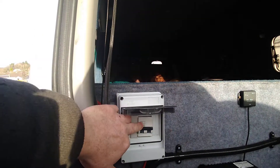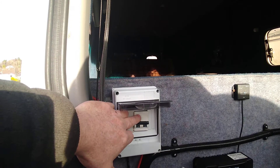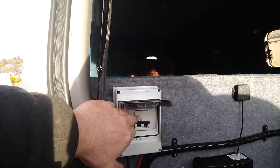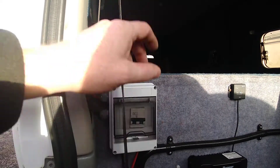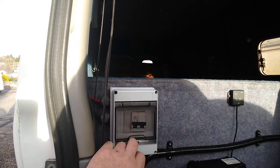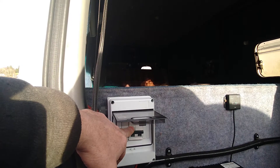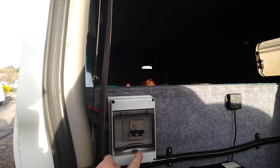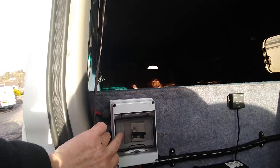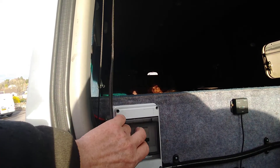What it is is a 250 volt 63 amp breaker, and it's DC rated. You would never ever use an AC one — remember, the power coming in is direct current, so you must use a DC breaker, not an AC breaker. This is the safe way to disconnect it. I'll leave a link in the description for where I got mine, and I hope this helps someday. Take care, bye bye.